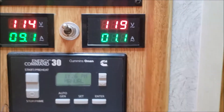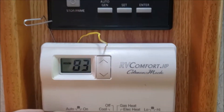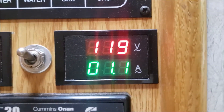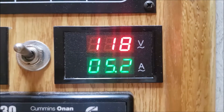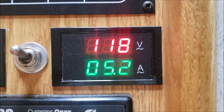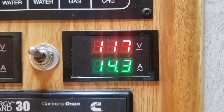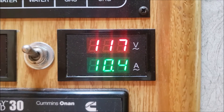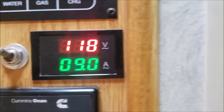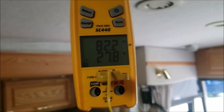A little sidebar — I've got a device in here that measures the amps on each leg. I'm going to turn the fan only on first so you can see the amp load. It's pulling 1.1 amps on this leg. Fan only draws about 4 amps. Now I'm kicking over to the compressor to see how much the draw increases. There it goes — I already had about a 2-amp draw, so it's running about 8 amps total with the compressor on.